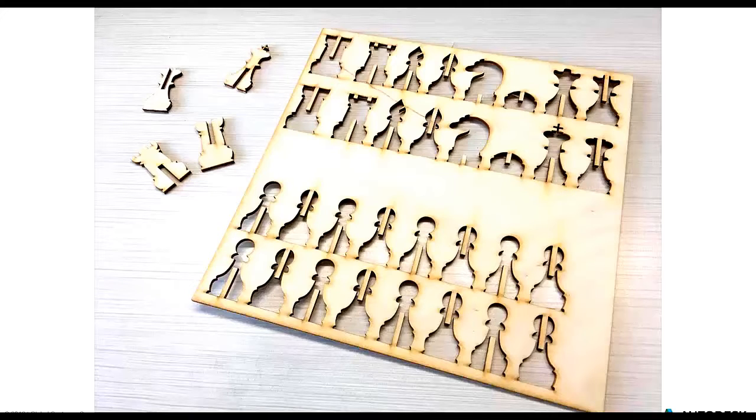There were some things that we did note: you will see some staining of the wood. It did get pretty hot, so maybe we could have played around a little more with the power and the frequency settings. But there were some interesting results for our first cut here. Yeah, and it's interesting too. We used either a laminated board or some kind of composite, and the glue from it actually made the edges sticky, and that went away with time, but that also contributed to the residue on the board. I think if we used a solid wood instead of a laminate, it would have come out a little differently, depending on which material you're using.